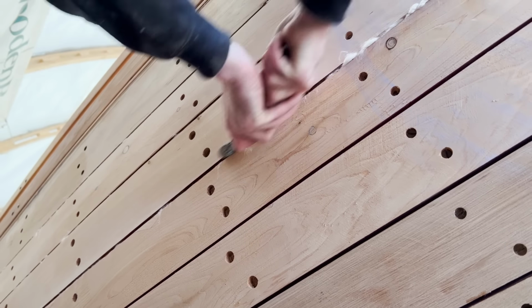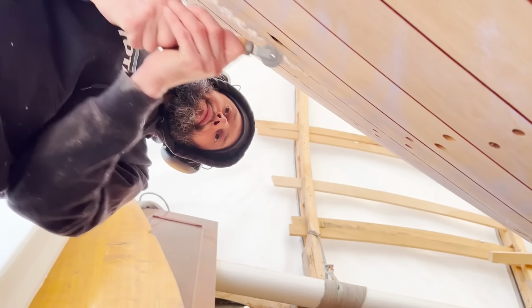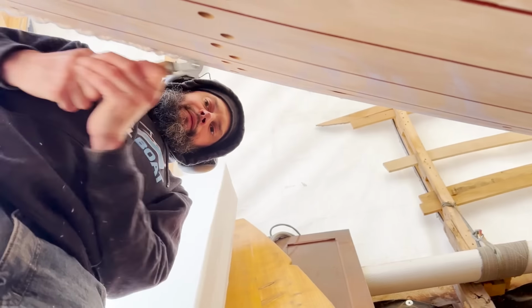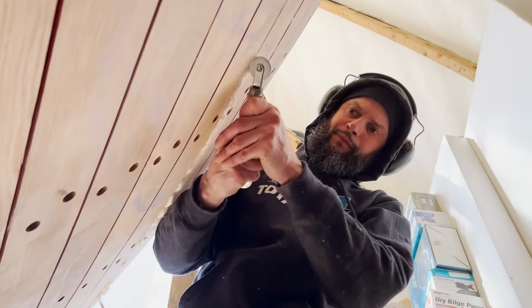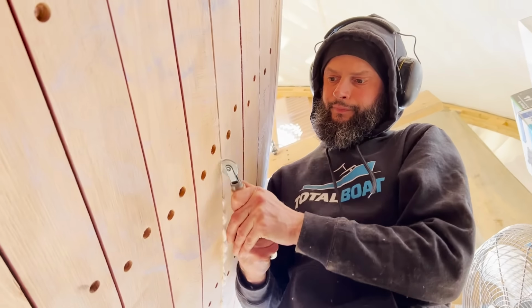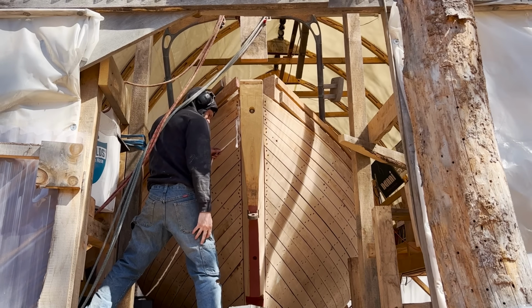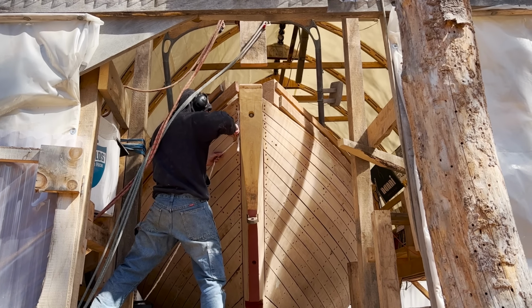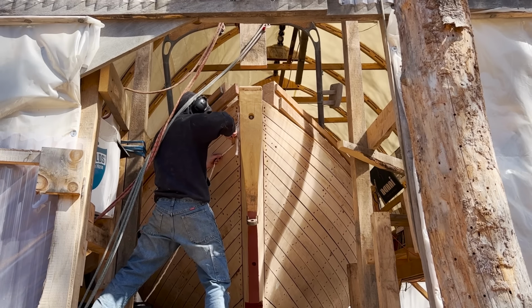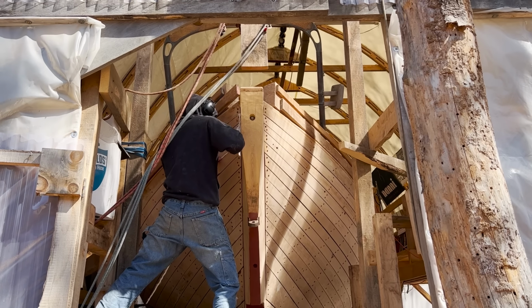Larry also talks about screws being better than rivets in terms of planks shrinking and swelling and the forces that they put on the fasteners. He also talks about boats that were planked too tightly with kiln-dried lumber and having the frames break and pull up to 1/4 inch apart, which is one thing that I am terrified of, and I really hope doesn't happen with Arabella.